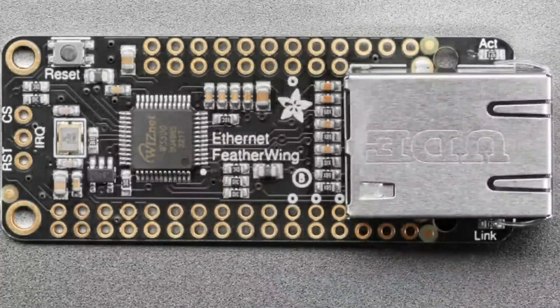But if you're designing something like the Ethernet FeatherWing and you want it to be a single-sided board optimized for space — I didn't have space in this design to have jack plus magnetics. Also, you get the benefit of having the magnetics inside of a metallic shell, which is grounded to your local device and helps shield it a little bit. So this has the magnetics inside the jack. It's kind of nice because you just connect the pins and you have maybe a couple of capacitors and a couple of series resistors required, but all of the electromagnetic stuff is handled inside.